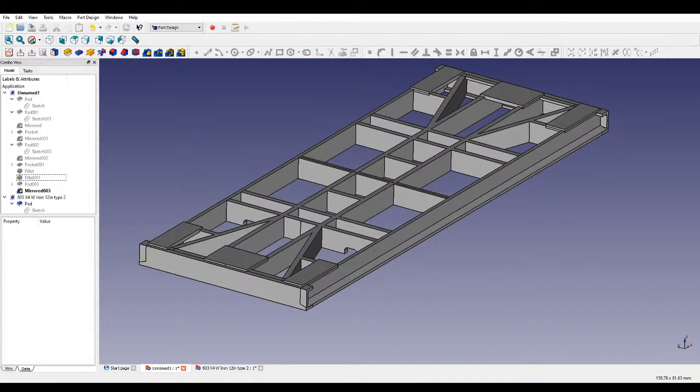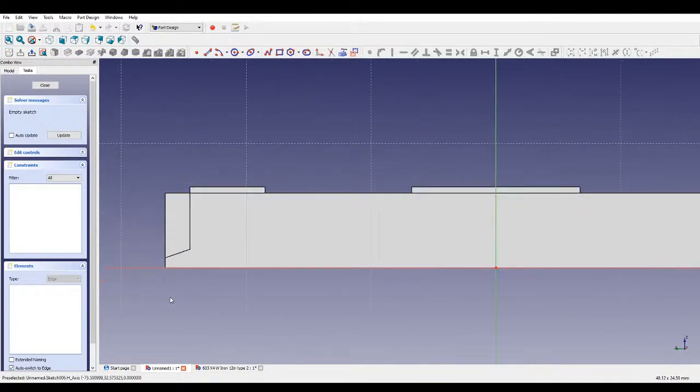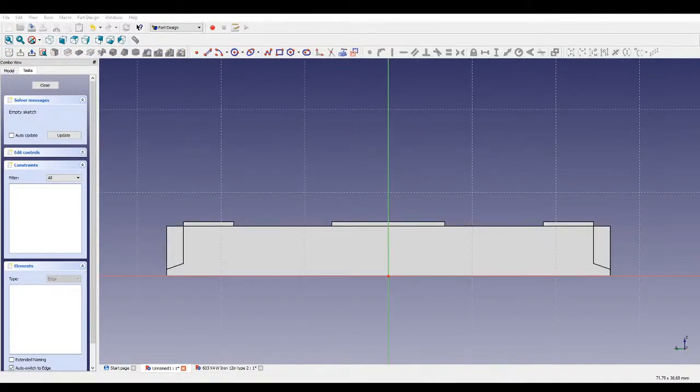So, next up, all the gubbins that goes on the ends of this, as there's quite a bit of it, and it's all fixed, for want of a better word. However, only one bit actually needs to be on here, and that is the coupling boss, as the restraining hooks, which are chained to the doors and the frame, are going to be their own separate pieces because they won't cast, as will the lamp iron, as will the buffers, as will the brake hoses. So the only thing I need to add is the coupling boss.